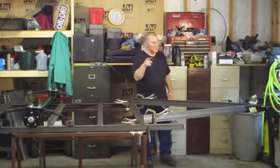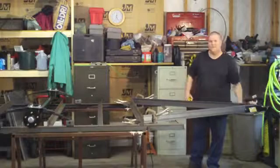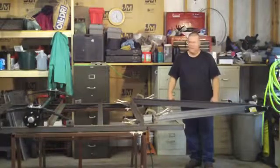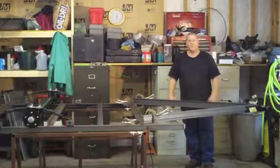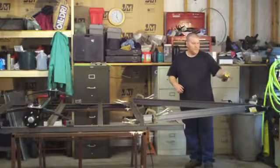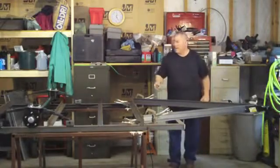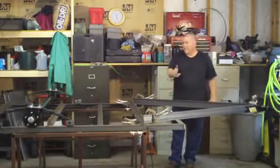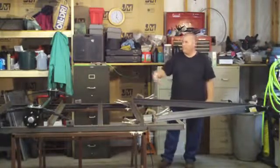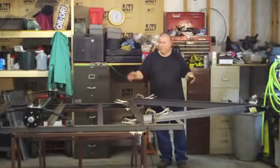Obviously, also, don't forget, when you mount this, make sure this is upside down when your trailer's upside down. It's real easy to forget about little things like that, and then you go to flip the trailer over and your hitch is upside down. You got to cut everything apart. As far as the hitch goes, I made it for a 2-inch ball, so I'm basically going to tack this all up, and now I'm at the point where I'm ready to weld everything while this thing is upside down. So I'm going to weld everything up.